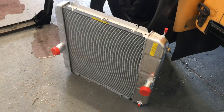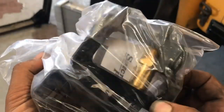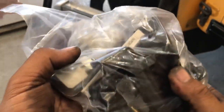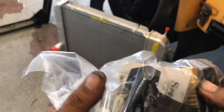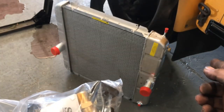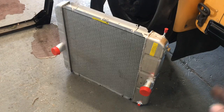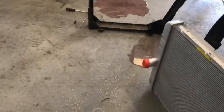There we go — that's the all-aluminum radiator. They also send us the connectors that go in front, needed for the transmission cooler lines, and these little molded rubber bushings, whatever you want to call them. And there's a little petcock in there, plus a nipple that goes off the side if you need it. In this case we don't use that one — it stays plugged. The petcock goes in the bottom, and the two radiator hoses and the transmission cooler lines go in front of the radiator.